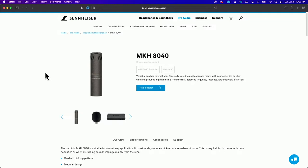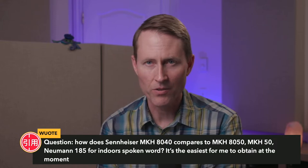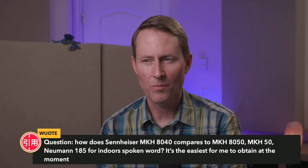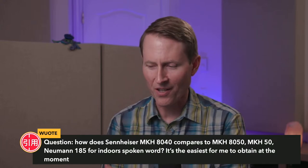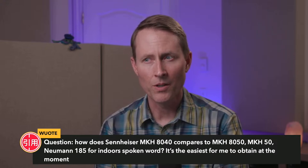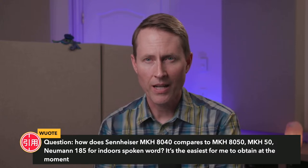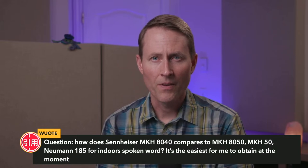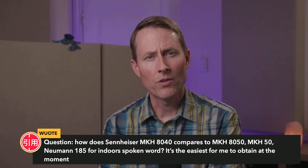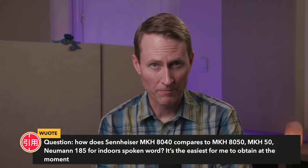Well, actually, let's go back to the question. There were some other mics listed there as well. MKH-50. The MKH-50 is a mic that has an amazing reputation, and it is a good mic. We use it at work all the time. I would just be careful. These all have character to them. They're not perfectly neutral, but the 50 to me sounds a little more mid-forward, like there's a little bump in the middle, and with certain voices like my own and many others, it can start to sound pretty harsh. So you may have to do a little bit of EQ. The 8050 tends to be a little more forgiving on that front. I have not used the Neumann 185, so I'm really not sure on that one. Anyone in the chat with experience with those, I would love to hear your input as well.